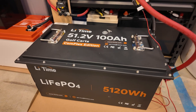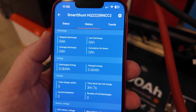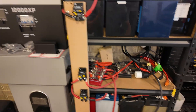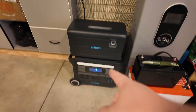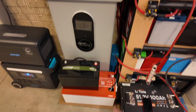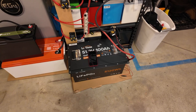Let's do a quick battery capacity test for this LeeTime golf cart battery. I've got the Victron Smart Shunt hooked up here — I've zeroed everything out in the app. This LeeTime battery connects into my two distribution bus bars and is powering my EG4 12,000 XP inverter. I'm taking that power and dumping it into a portable power station to recycle the power. All of the other batteries on this shelf have their disconnects pointing down, so the only battery currently energizing this system is this LeeTime golf cart battery.